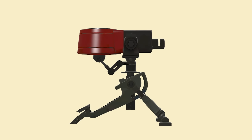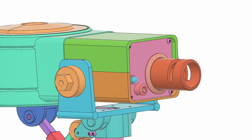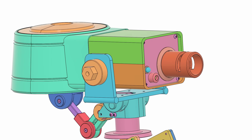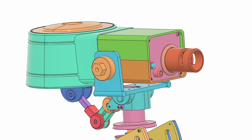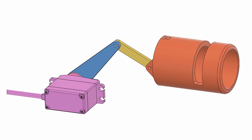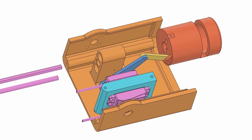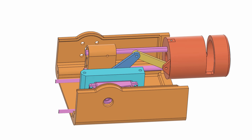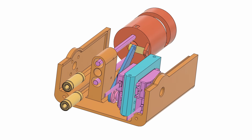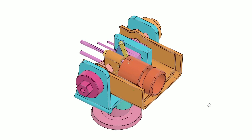But we're not done yet. This little guy would probably simultaneously melt, fall over, and explode if it were to use real cartridges, but I still want that satisfying recoil barrel action. We need some kind of linear slider mechanism to draw it back and forth, so I added a tab with a hole toward the rear that connects to a link. That link connects to an arm, which attaches to a servo horn, which meets with a servo just below the pitch servo. This crank can now pull the barrel back, but in order to guide it, I added two 6mm D-profile shafts to the barrel, which can be secured with two set screws. I also added two linear bearings, which rest within a post on the lower housing. These constrain the barrel and crank slider mechanism and allow it to glide back and forth smoothly.